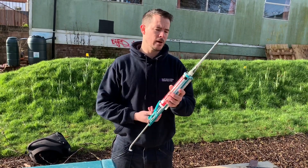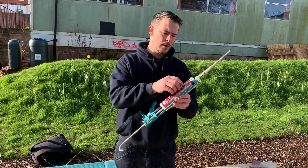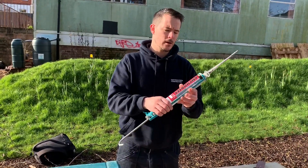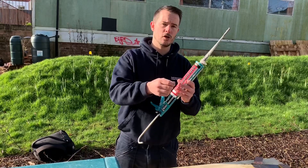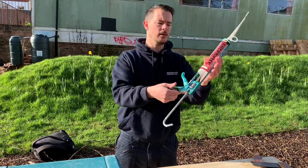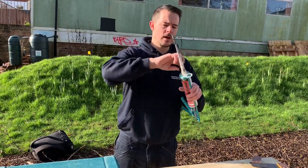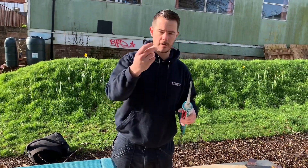So I'll explain how it works. You've got two parts to this that are separately placed in a bag within this tube. Sometimes different types come as two tubes that mix into one, but this one allows you to use it in a standard skeleton gun. There are two bags within this — you cut the bag on the top and take the little cap off. You can use it again and again if you put the cap back on.